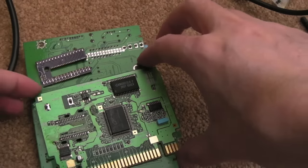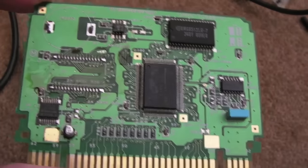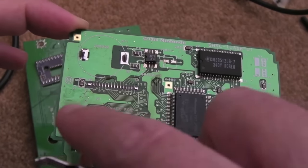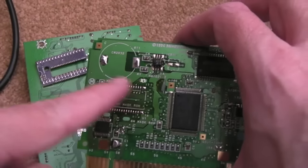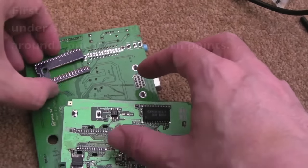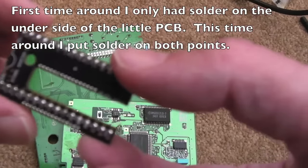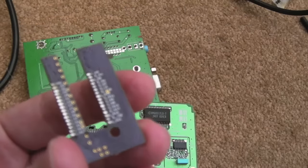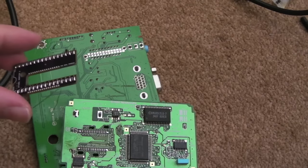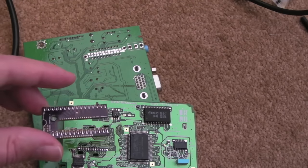Second attempt here. I've had to take the board off and flow some solder on there. I could actually tell when I removed the board that three or four pins had just not flowed. So I've put extra solder onto all of the contacts with some flux, and I'll reflow the solder on the underneath to make sure there are nice large blobs. Then I'll put it back on, use hot air again, and just hope for the best. This is not the easiest thing to do, I have to admit.